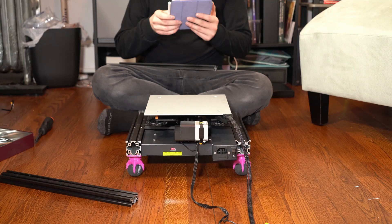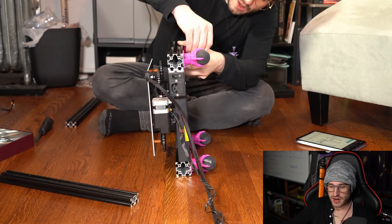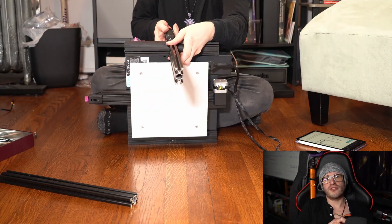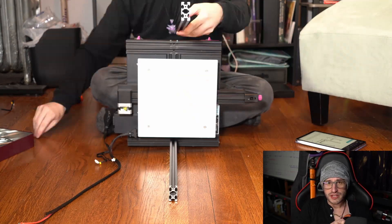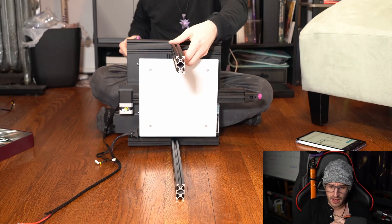This is how the printer ships. The whole base and the build plate comes pre-assembled because it's kind of a pain to put together yourself. So the first instruction is to just attach the z-axis rails. It's really important that the printer axes remain flush with each other, so I kind of just loosely attached everything and then you'll see me come back and re-tighten everything later.